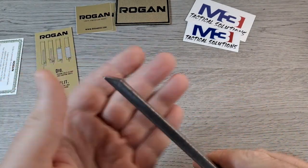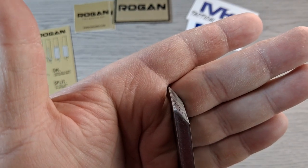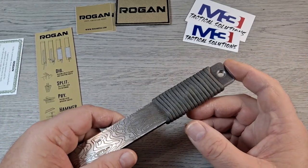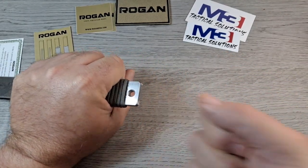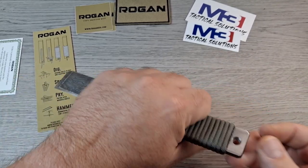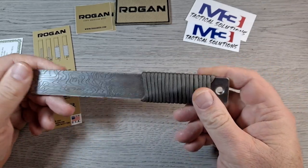It's got a chisel-type grind to the edge — not sharp, but a pretty good edge right there. It's blunt but not real thick. It's not a chisel, and the website says it's not designed for repeated steel hammer strikes. If you hammer on it with a steel hammer repeatedly you're going to mushroom it over, then it'll chip and chips will go flying — you'll pretty much destroy it. If you need to beat on it, definitely use a brass hammer, since brass is softer than the steel.